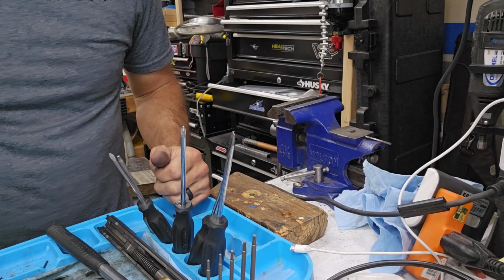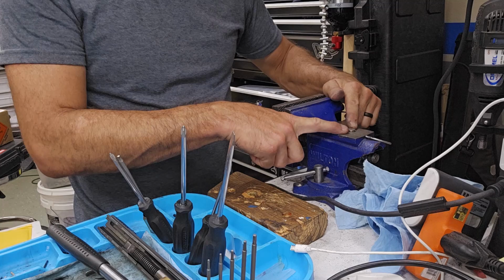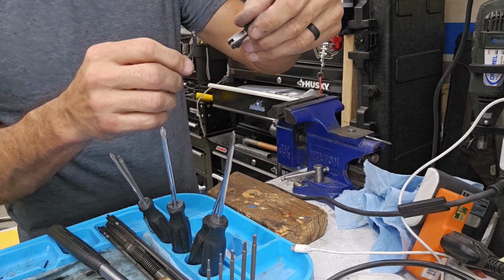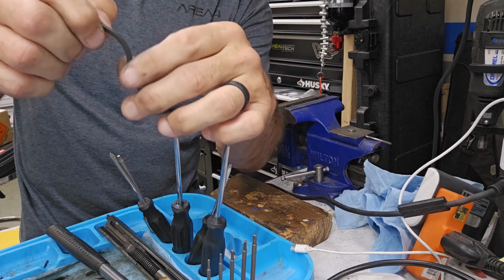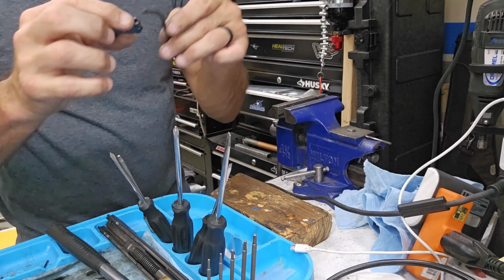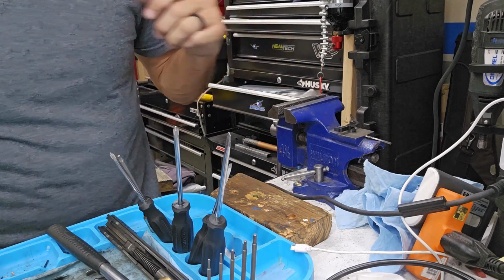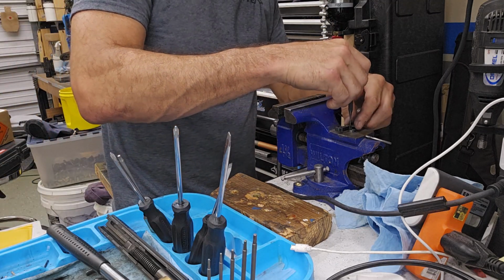All right, so first thing I'm gonna do here is get my hammer. So here's the trick. I got this flat base of my vise, and I have a magnet. So my hammer is gonna be there in a magnet without moving. I put the hammer strut in the position that I want, and the hammer strut goes back in like this. Like, that's how it's supposed to go in, with that kind of a belly here towards pointing forward in the gun. So this goes that way. To make sure it's aligned, I'm gonna put the race hammer in a magnet here, put the hammer strut aligned there, get a punch, that 1/16 punch that we've been using for everything so far, and just go in the hole and make sure everything is aligned.